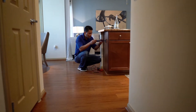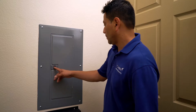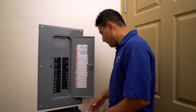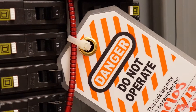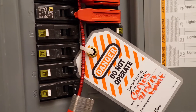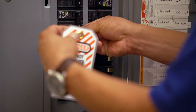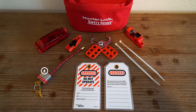It's important to lock out and tag out correctly when working with hazardous energy. Anytime you're completing work orders that involve hydraulics, pneumatics, plumbing, and electricity, you're required to use your lockout tagout kit. A lockout tagout is required for every person working on a repair — if there are six technicians, you'll need six lockout tagout kits. You could be seriously injured from an unexpected startup if you don't follow the lockout tagout process.